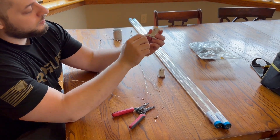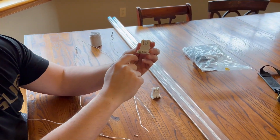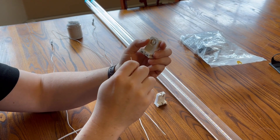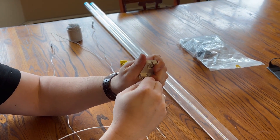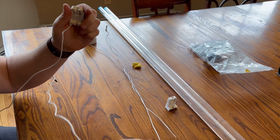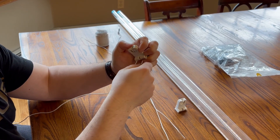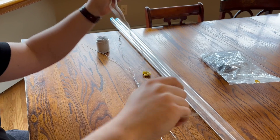You're going to take this wire and shove it right into these terminals. There's two terminals if you wanted to daisy chain them. I'm not going to do that, so I'm just going to shove it in there and push it until it clicks. Make sure it doesn't pull out. Then I'm going to take the hot one which has the black tape on it — that's going to go on this terminal. There's one done.